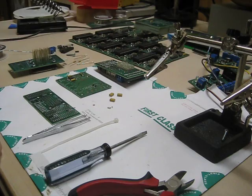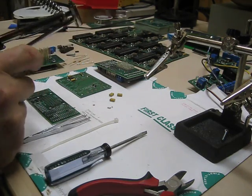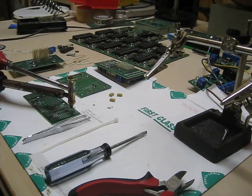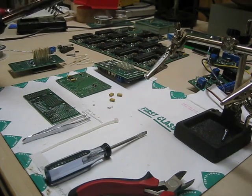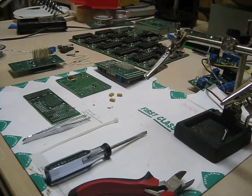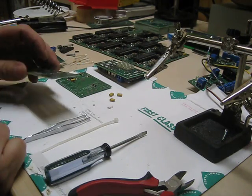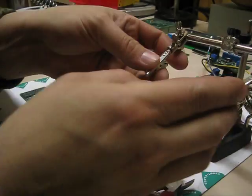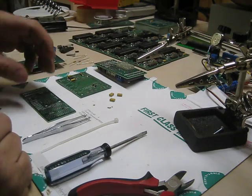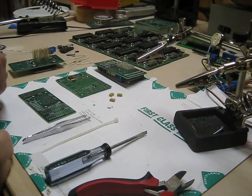The other soldering iron I use a lot is a little desoldering iron with a little ball on it. The tip has a little hole in it, and when you put that over the top of a lead sticking out the other side of the board, it makes really good contact for sucking all the solder out if you need to remove some components. Sometimes I'll even use this to help solder components in, especially in areas where you have a lot of grounding. Grounding tends to suck all the heat away and solder doesn't want to flow very well.